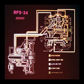Pressurized oil is also directed from the selector spool into the C3 pilot circuit, which is routed through the open C3 retard valve check ball. The C3 pilot is actuated, permitting pressurized oil from the supply gallery to pass through the pilot and into the C3 clutch. The steering return, reverse lockout, and clutch lubrication circuits are functioning in the same manner described in the low drive illustration.